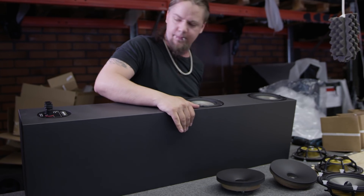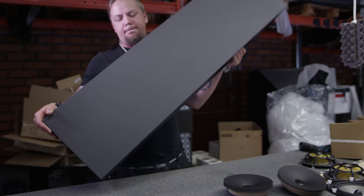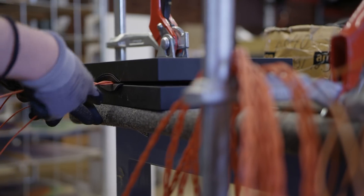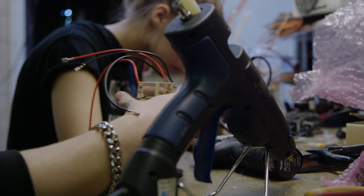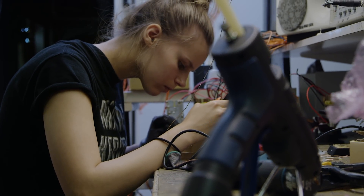So what you're doing with the passive radiator — and this is a big surprise — you're actually cleaning up the mid-range. The 3S and 3LS have a single passive radiator matching that of the woofer, and the 7LS has two of them. To ensure a flawless signal transfer, we're using a high-quality three-way Argento binding post, and the internal wiring is silver-plated high-purity copper.